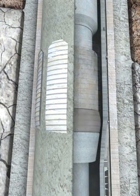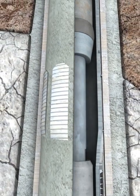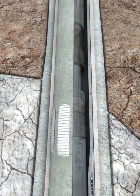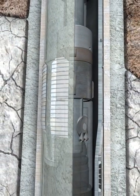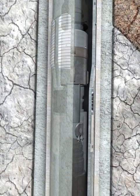Once cement has been fully displaced up the annulus and circulated through the bypass slots around the slips, the running tool is picked up further, allowing dogs to move outward and rest on the formed shoulder. Additional downward travel releases the curved flapper to a closed position.